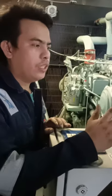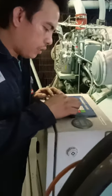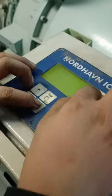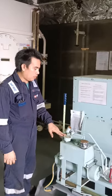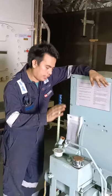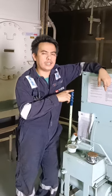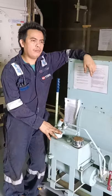After we test this hydraulic, we go back to local — just enter, lift mode — so now we are back on emergency mode. For this emergency generator, we used the hydraulic. It is manually operated, and we need to refill it again for use in case of emergency, in case the electric start does not work.